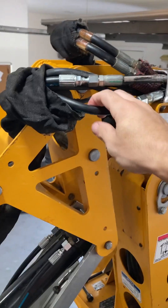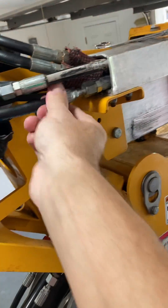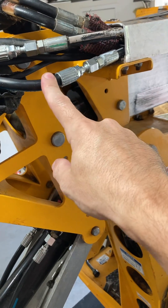Another quick tip on this upper jib and basket: all of these have a short connection — about a three-foot hose that runs up here. Sometimes these slide back up in there so you can't find them, but they were smart enough to give you an opportunity to just replace the short end of the hose instead of 60 feet.